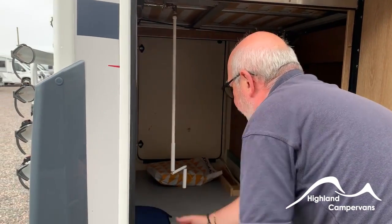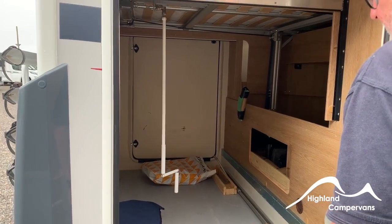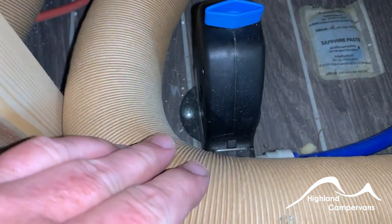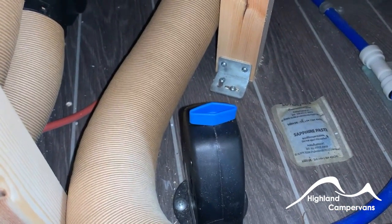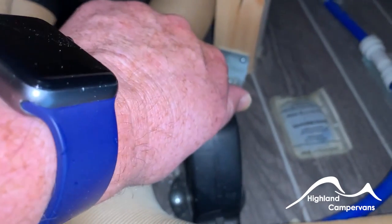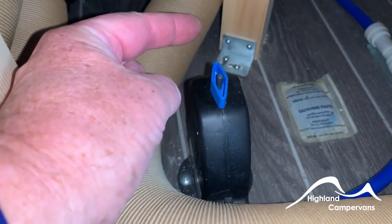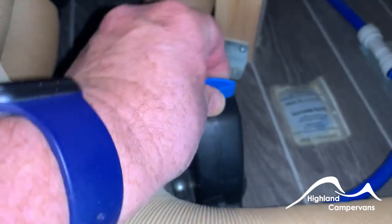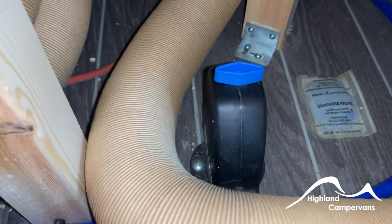In a cupboard at the back of the garage you'll find the frost protection valve. At the moment the valve is in the open position — the diamond lever is in line with the pipe. When the temperature drops below about three degrees Celsius, the valve activates and water starts to drain out of your boiler, with a blue button popping out at the back. To reset the valve, get the temperature up to about 10 degrees Celsius, close the valve, put your hand down the back, feel for the button, and push it in.